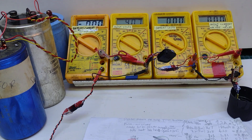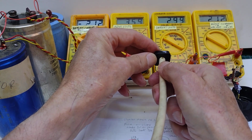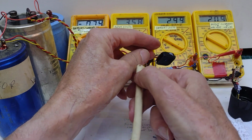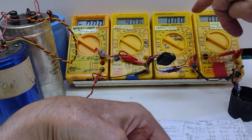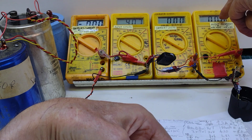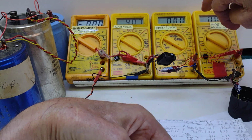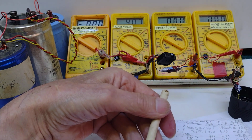Well, if I blow into it, now of course I'm blowing in rather than sucking on the other side, or reducing the air pressure on the other side, to get this to work. So I'll just try that. Let's see if I blow. And hopefully we can see that there are about 2.99 volts on this, and that this was going about 2 amps, and therefore if we multiply 3 and 2, 3 times 2 is 6, so we're sort of looking at 6 watts.